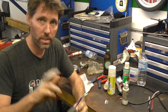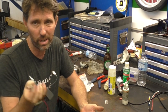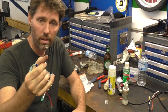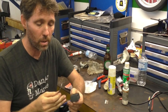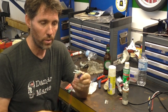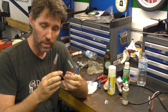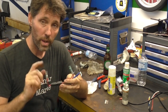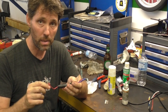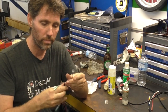Here are the twin green wires. Because this is an AC current that oscillates, there's no positive and negative — it really doesn't matter much which way these go round, although I notice one is green and one is green and white, so I'll have a look under the flywheel. This is our ground — a short lead with a ring connector — so we're going to find a bolt on the engine block to put that directly to. Then we need to go from that same bolt off to the negative, and I also need to take a positive off. This has two positives: one fused and one from before the fuse. The one I'm going to send to the battery is the unfused one. The fused one can be used to power accessories, but in this case I'll just be leaving that one alone.